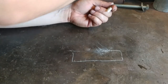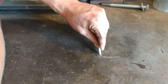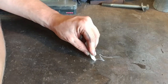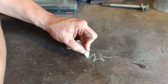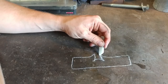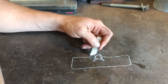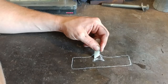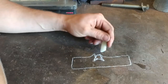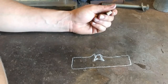I'll show this to you again when I'm over at the workbench, but I'm going to try to do a little expanded view here. Essentially we're going to raise up a barb that is kind of cut back in like so — it'll have a bottom, kind of a crowned bottom. We will fill this area with the wire of the correct gauge, and then this all gets hammered down flush, which essentially pushes the wire down into the barbs that you've cut and traps it in amongst the steel.